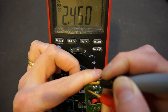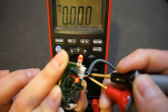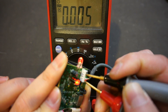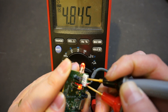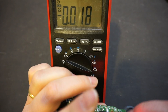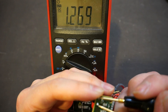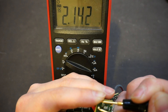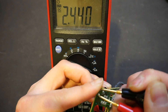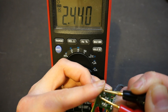This is actually a little bit interesting. Usually this voltage would match the USB supply voltage, which in this case is 4.8V — a little bit lower than the nominal 5.0V. But the pull-up voltage is just half the USB voltage here. I'm not sure if that has any significance. But the idea is: if we can have a device that changes this output to be high and low, then we can actually simulate the mouse click.